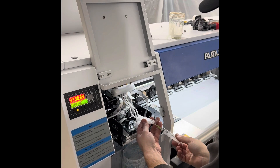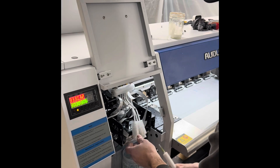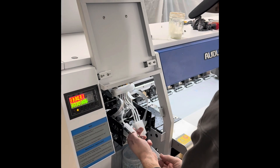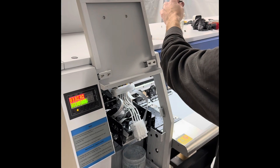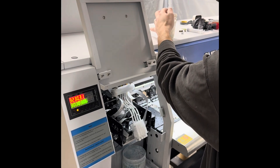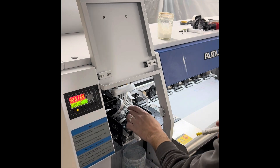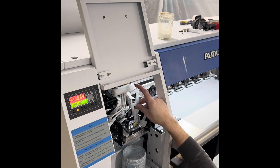Like I said, it should only take about 10 minutes. It's been about six minutes since this segment started, and I'm going kind of slow to explain it to you guys. I've got my syringe full of white ink — just going to wipe the tip off, but make sure not to get anything funky on the inside because you don't want to push that into your printhead. Observe on the bottom and prime the white ink, maybe three milliliters each per manifold. Push evenly — it's much more viscous than water so you won't get a stream on the bottom, but saturate it as much as you can.